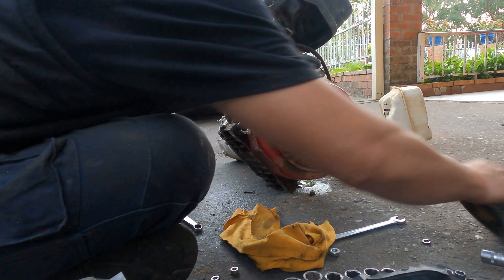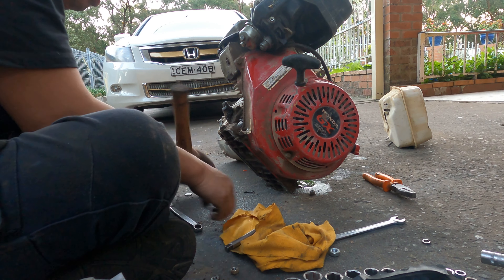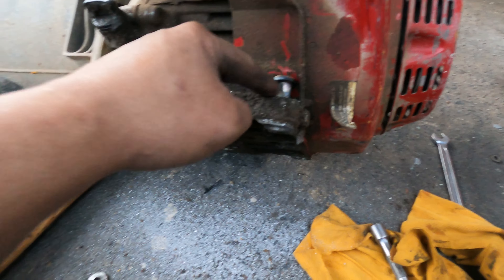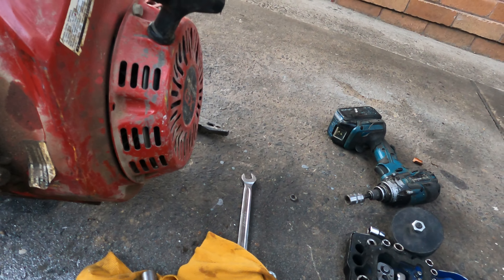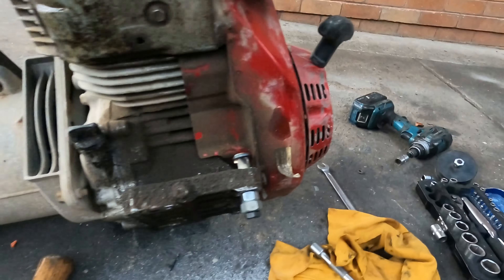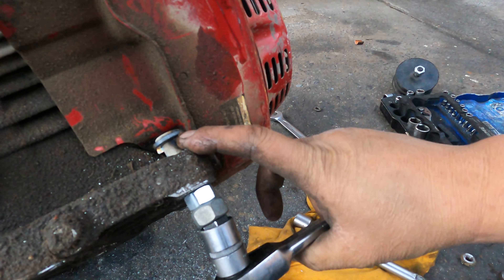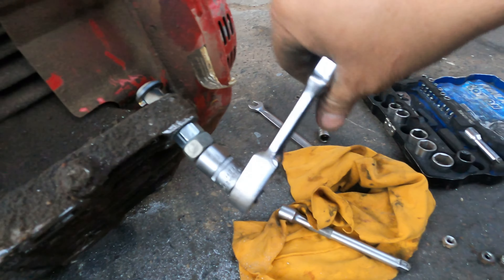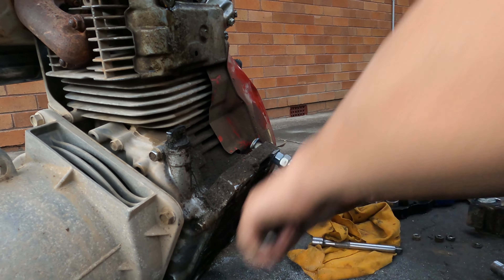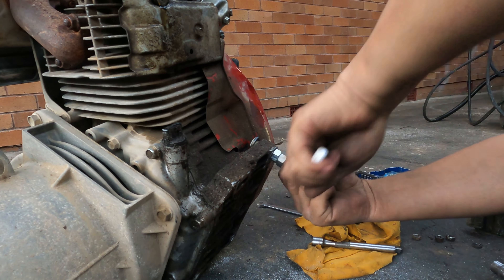No more for today, we'll come back tomorrow. Happy New Year! Now the trick — how to get this one in — is you can't get the hammer in here, you've got no force to knock it down tight. So I use another bolt the same size and use it as a hydraulic. Turn it down — the tighter the better. I put a spring washer on to help hold it there.